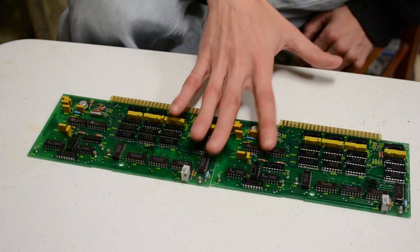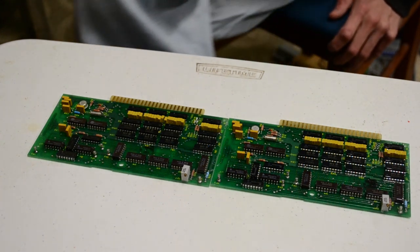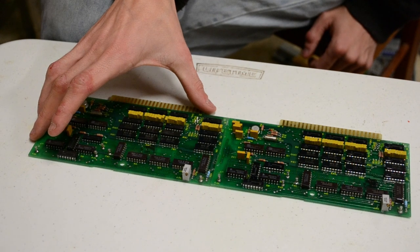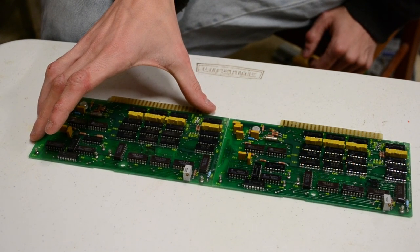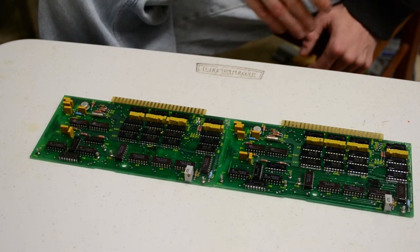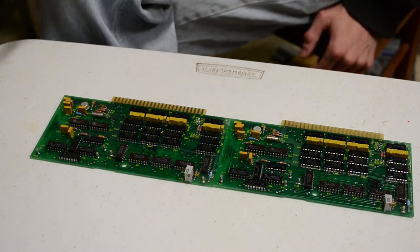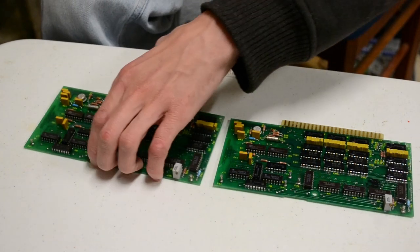So there's two of them because one of them is for ARINC 542 Extended. And I believe Extended is for things like third and fourth engine, a few other parameters that weren't actually recorded on foil recorders. So newer planes could use the older system but record more data. Tapes are brilliant for that.